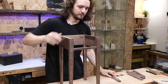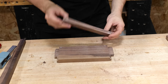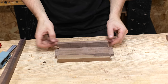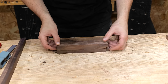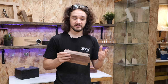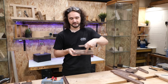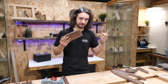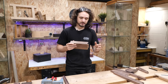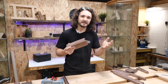So let's get it disassembled and I'll show you the easiest way to permanently fix these runners in position. These are the side rails — I've numbered the inside faces to match up with the drawer runners. All we've got to do is fix it in position flush on the bottom. Biscuits or dominoes are a really good option, as those machines are designed to make flush surfaces. But I'm going to simply glue and screw this in position and make it look quite neat.